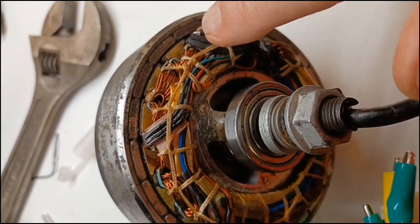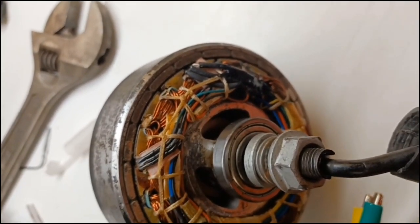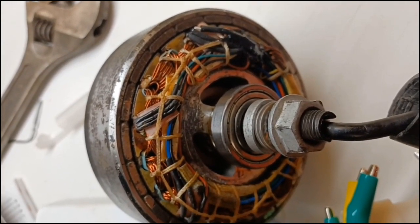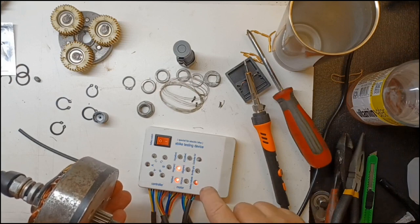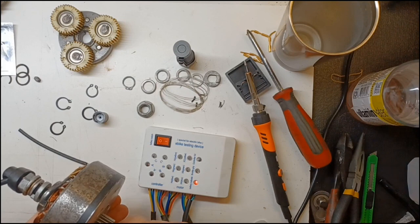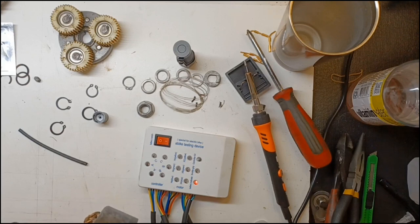As we rotate it, it will determine the direction and rotation of the magnets. As you rotate it, the orientation has to provide feedback that goes to the motor control system, which will then fire off the voltage to whichever coil is next in line. As we rotate it, you'll see the little LEDs on that column I was pointing to earlier light up.